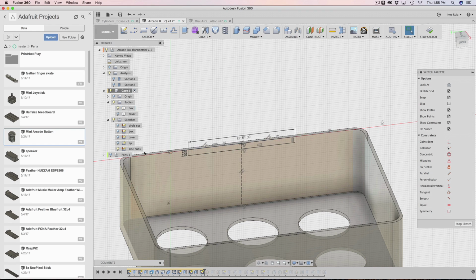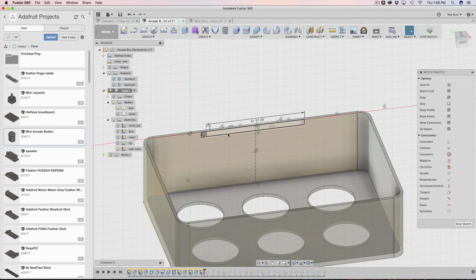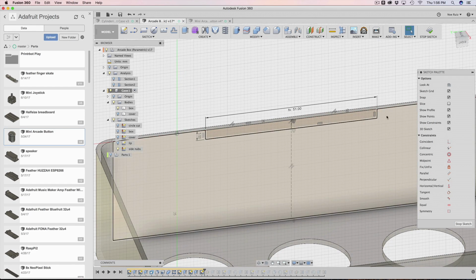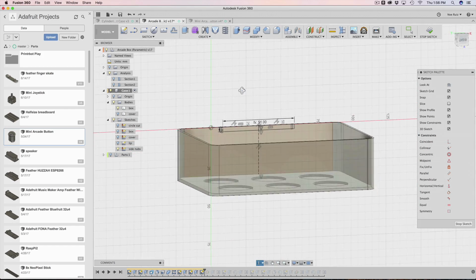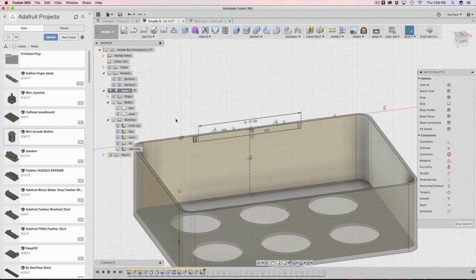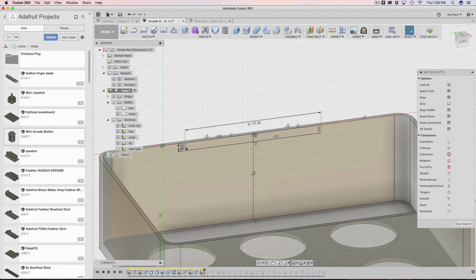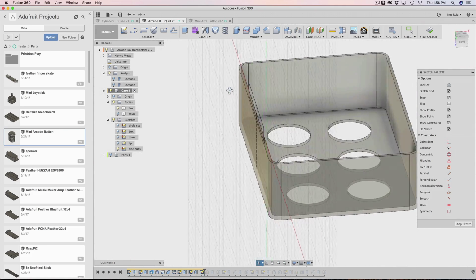You might ask, well, why didn't you go across this whole thing? It's mainly because when I tried doing that, it kind of bowed. Having more friction points on the left and the right just makes the snap fit behave a little bit better. So it's more of a manufacturing thing. When you print it out, it actually doesn't work if you just do lip all the way around. Try it out for yourself if you don't think so. But the next thing is figuring out how do I make this nub also be over here.